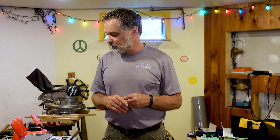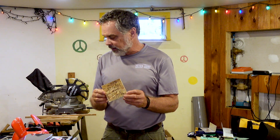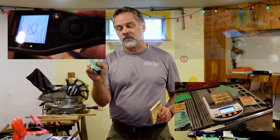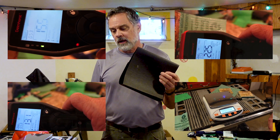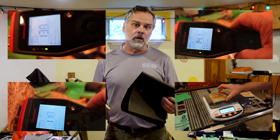The results showed a significant increase in percent moisture content as measured by the moisture meter, backed up by weight measurements on the scale. We're not talking a lot of water given the small pieces and limited contact area, but we did get measurable moisture gain with the GreenGuard Raindrop and also less — but some — with the GreenGuard Classic Wrap. We got the least gain with the building paper. The old die-hard material, as a weather-resistant barrier handling moisture held in tension between two surfaces, was the best performer of these three.